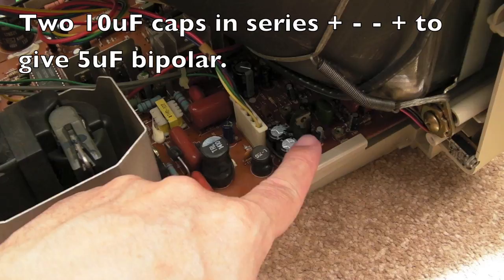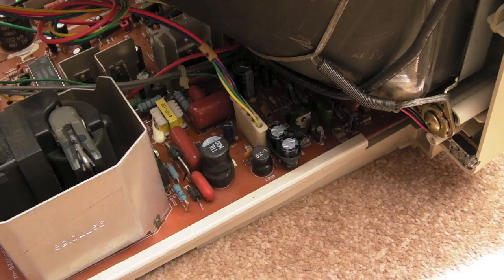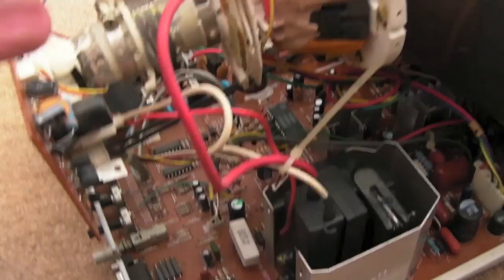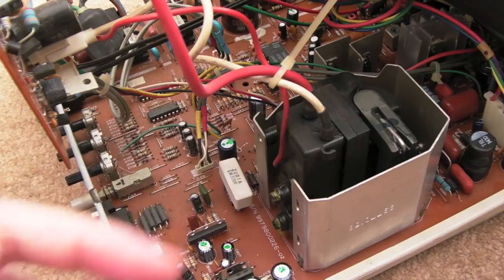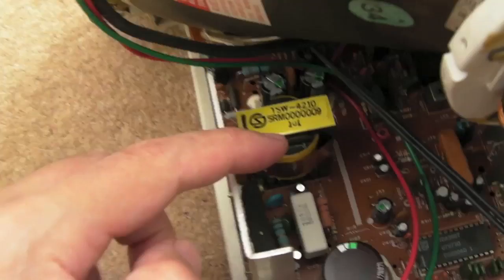I'll probably remove this because it's just the same - still got the same frequency issue, and we've still got the same issue where you first switch it on, you get what looks like a missing blue. The blue seems to just come off its own accord after maybe two or three minutes. So we could be in the realms of something going on in the neck body - it could be the tube, I'm just wondering if there's a problem with the blue gun. This is one of the problems we get with a set of symptoms like this right from the start where there were quite a few caps, and I don't think all the caps need to be replaced - I've still got them, I'll get around to checking them on my ESR meter at some point.